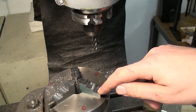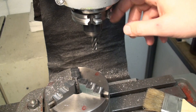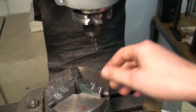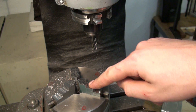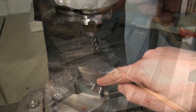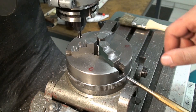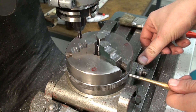I just ran the outside steps around with a 10mm carbide end mill to clean it up and let it run true with the chuck itself. Now I'm going to change over to a 90-degree chamfering bit and chamfer the edges. I put the deburring bit in the spindle, set it in the right position, and I'm going to rotate around.